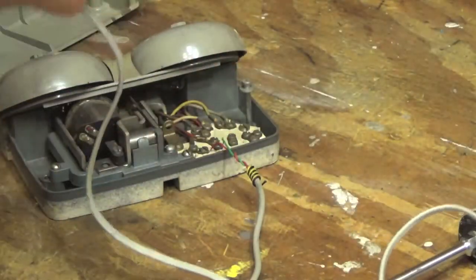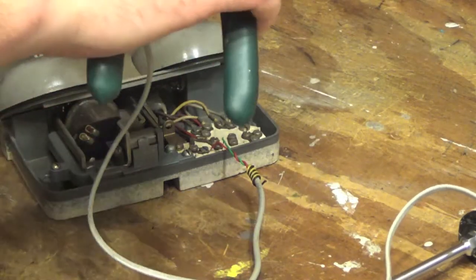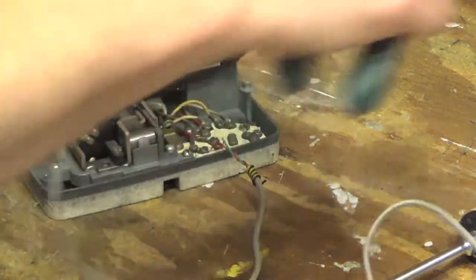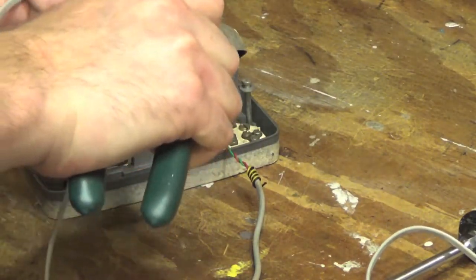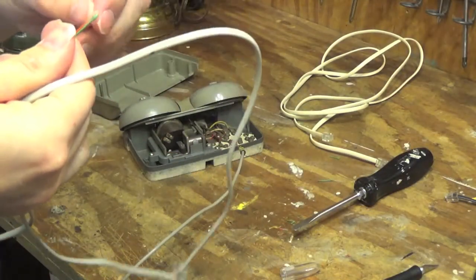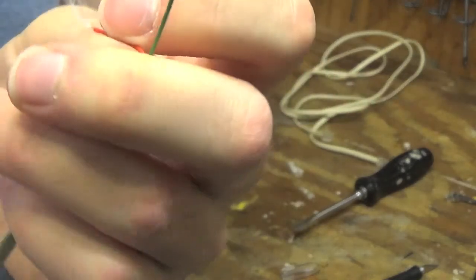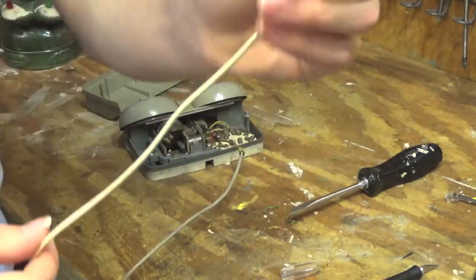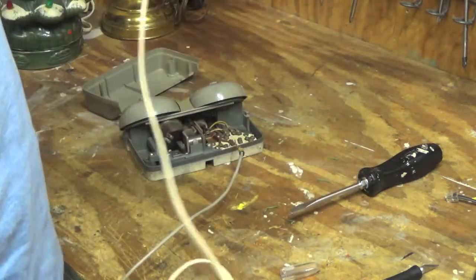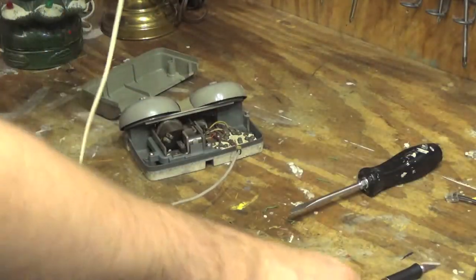So that should be easy enough to wire a new cord to. I'm going to get a new strip on here because it's pretty crummy. This wire is too small for these strippers so it's not going to work very well. There's something wrapped in there with the wire, so even if I could get a good strip on it, I don't think it would make a good connection. So I have this other cable with a broken connector — I've got to cut this off and replace it anyway. I figure I'll cut this off and see if this wire happens to be strippable.